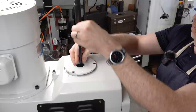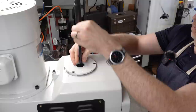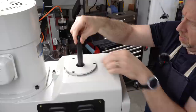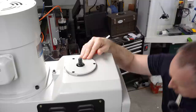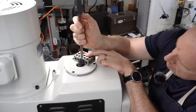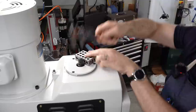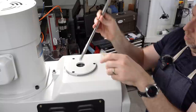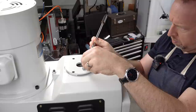Up here on the top of the mill, we'll start by pulling out the original drawbar and replacing it with the one that came in the power drawbar kit. It should just drop right in, but before I do anything else, I want to check the length. The manual says this shoulder needs to be recessed into the top of the mill by about 50 thousandths, so I'm zeroing my calipers on a 1-2-3 block in incremental mode and using the tail rod to check the depth. It looks like we're about 21 and a half thou. I think rather than modify the drawbar, I'll just make a 30 thou shim — next time I place an order with SendCutSend I'll order a stainless shim to put underneath the motor to get that extra space.